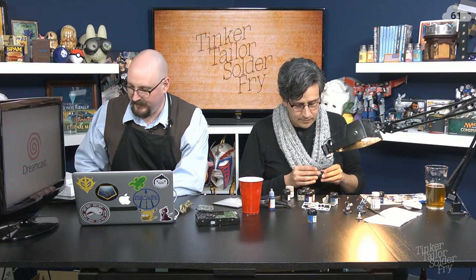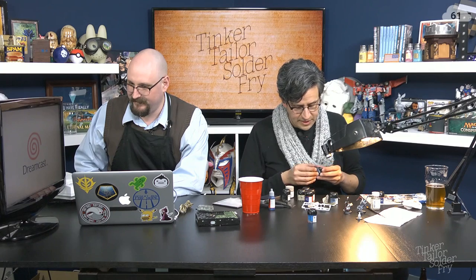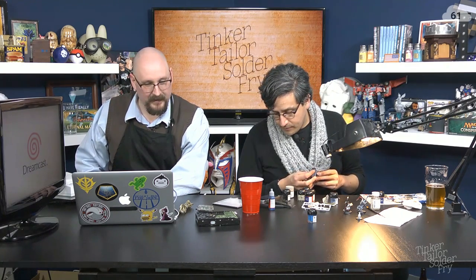Oh, I have to go back to the drawing board. How did you guys get into space? This is a problem. So the reason I'm looking for CDRs is I'm hoping that maybe by burning a new bootloader disk, we'll be able to get this up and running. I think that seems to be what the problem is right now, is it's not reading the CDR to even get to the point where it should be looking for either the SD card or the hard drive. Come on. It sounds like you can do it. It's thinking about it. Ian, yes. I want to know how you're going to burn a new CD if your laptop doesn't have a CD drive in it. We have other computers in this office that do have CD writing drives. Thank you for clarifying. Till then, we'll just keep rolling the dice.